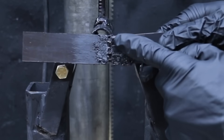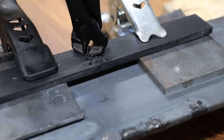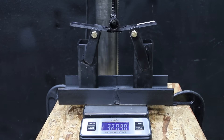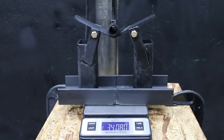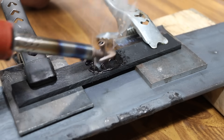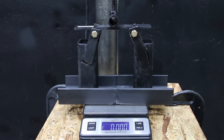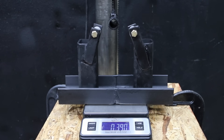Repairing a second All-Turn piece with melted plastic over the repair area, the All-Turn seems to make a lot more heat than the RX Weld, taking about a minute to melt the plastic over the mesh. The wire mesh helped strengthen the repair to 32 pounds, and testing the opposite side came in at 36.4 pounds. The June Jip and the RX Weld may look a lot alike, but the June Jip makes a lot more heat. The plastic weld stick becomes more liquefied, and the repair looks a lot better. The high heat really helped — 61.9 pounds, almost as strong as the undamaged test piece.